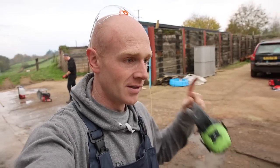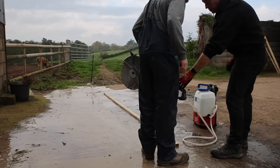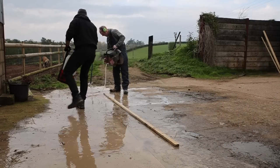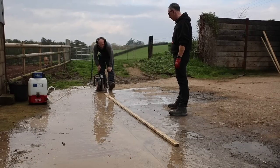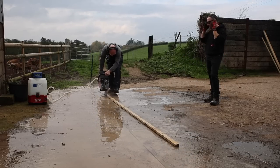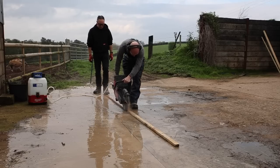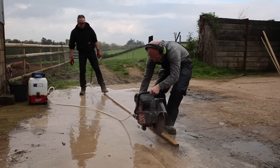We've made a good start - we've done the full 20 to 25 metre stretch all the way along. We came off course a little bit now and then - that's just because there's a load of bumps and lumps in the concrete where bits are missing. So what we're going to do now is a bit of a comparison: freehand it, and we're going to aim for about 300 mil just under of a channel all the way along. That way we can come back in afterwards and just break that out easier - floor saw versus handheld, and see how we get on.